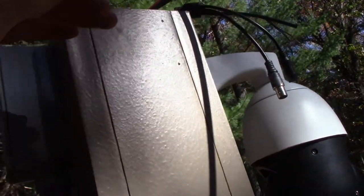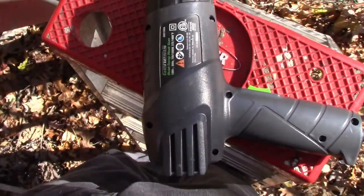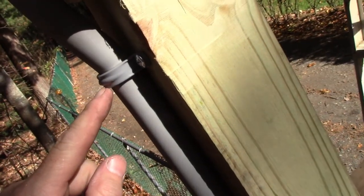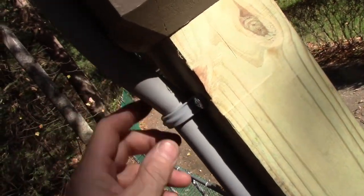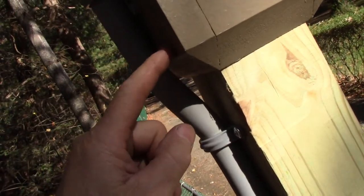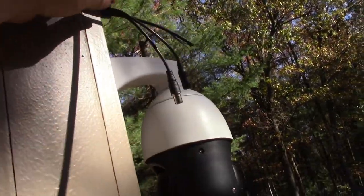So we've got the conduit running up here. If you need to make a bend like this - going up, going in, coming out the roof - all it takes is a heat gun. I'm not sure if a hair dryer will do it, but this stuff bends really easy. Just heat it up, loosely position both ends, heat the middle section, and suck them in - it's perfect. They do make a little offset piece that zigs and zags, but this is an inch thick so making your own is the way to go.